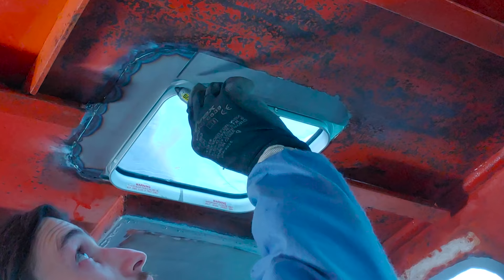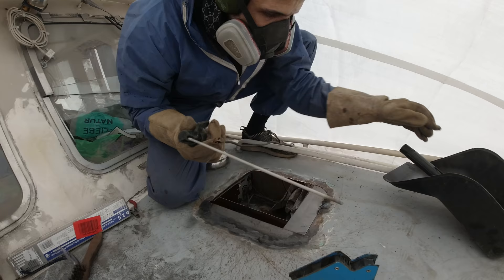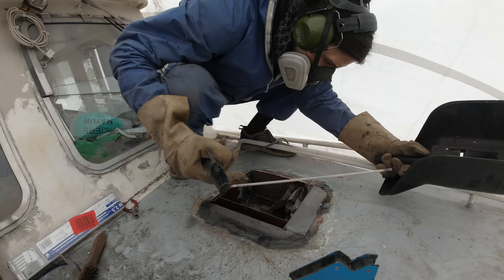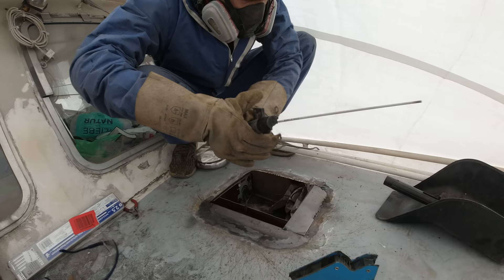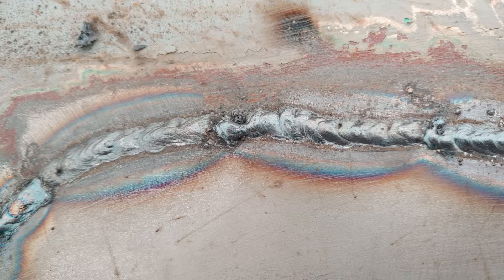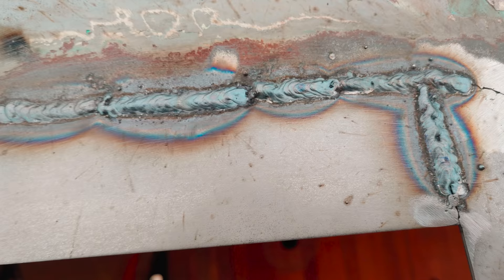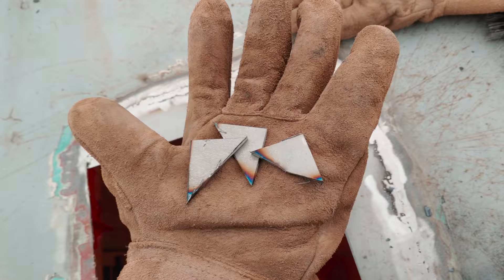Next let's cut and fit the second big piece. Once again I trace the outlines of the needed shape directly onto the piece and then cut it out and trim until it fits perfectly. At this point I ran out of wire for the MIG welder so I had to go back to the stick welder. I implemented some changes to my technique and the settings on the welder according to all the numerous comments I got from you guys and managed to get much better welds than ever before. The trick here was to increase the amperage on the welding machine. Finally I put in the three little corner pieces.